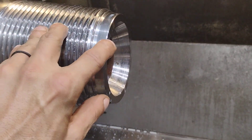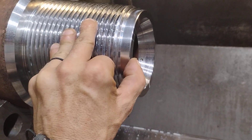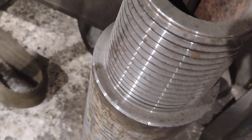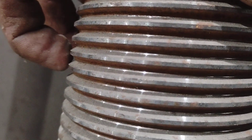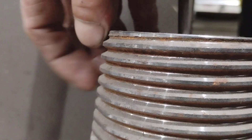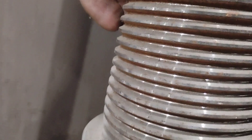It has to be 5.426 to 5.429 inches. Right now I'm at 5.427, so I still have two thousandths to reach max length. On a standard rotary connection — this is a small version — this is a three and a half IF pin, same thread style and profile. This one is only 121 thousandths deep, while the one in the machine right now is 147 thousandths deep.